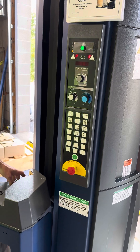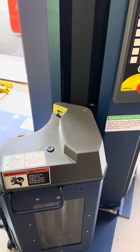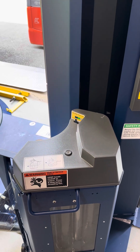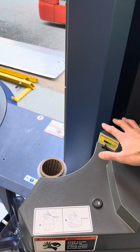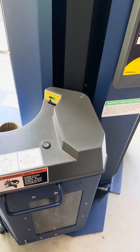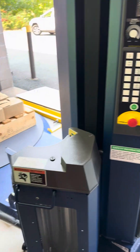This is the film height above the load. After the eye sees the top of the load, it'll go eight inches higher, so you get that over-wrap over whatever you're wrapping. That's pretty standard. You can adjust it right here — you'll see the eye, it just goes up and down on the bracket. Also, the arrows on the film need to be pointed up.